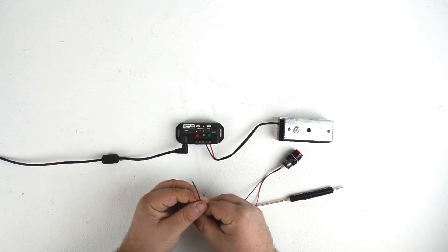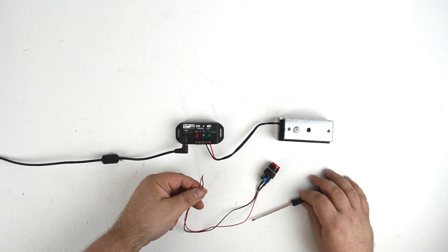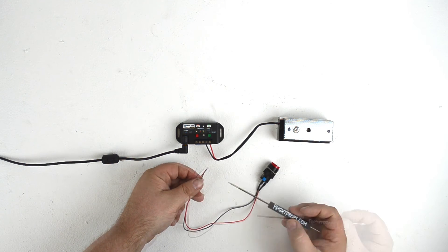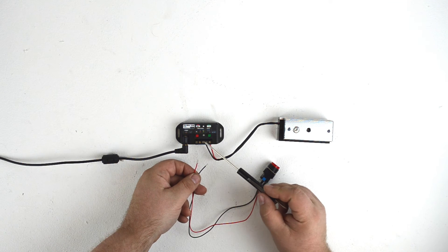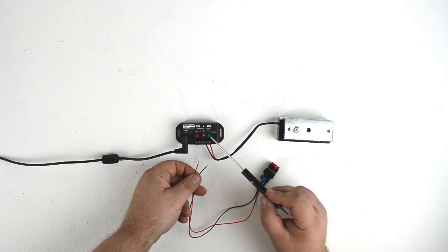You can see the button has two wires, a red and a black, although color is irrelevant on these low-voltage triggers. The trigger input of the Peekaboo has three terminals: negative, positive, and in. With a simple two-wire trigger that doesn't require power on its own, you simply connect one wire to the negative terminal and the other wire to in. It doesn't matter which wire goes to which, just as long as one is in negative and one is in in.